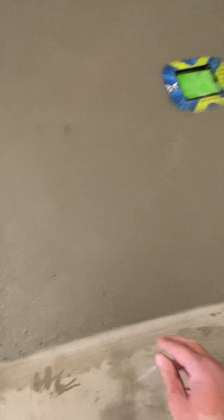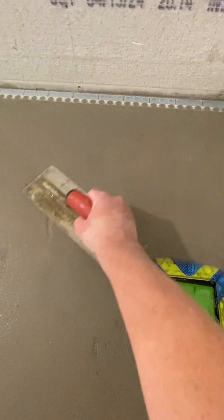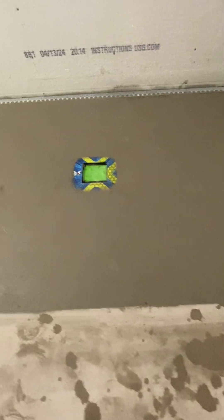It's been about 20 more minutes. This is almost firm, still a little bit dewy. At this point I'll take and wet my flat trowel down, then just very, very lightly smooth the surface off — that'll make sure there's no bumps or fibers sticking out. In about 30 minutes this will be hard as a rock. And that is how I do a 330 fast pan shower thin application float. Again, do this at your own risk. Don't say I told you it was okay, even though it is — but you've got to do it right. Good luck. Have fun.